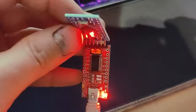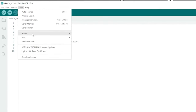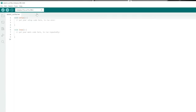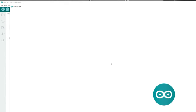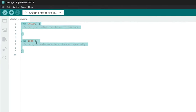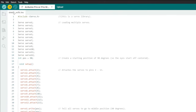Here I've got my Arduino Pro Mini. You can use any Arduino in the lineup, but I'm using this one because it's nice and small. In Arduino IDE, we select the board that we have, which is an Arduino Pro Mini. Following that, we select the processor we have — I will link the board I'm using in the description so you can select the same. We start a new sketch, delete the text that's already in there, then copy and paste the code I will provide into the file and click upload, after which it should be uploading and done.